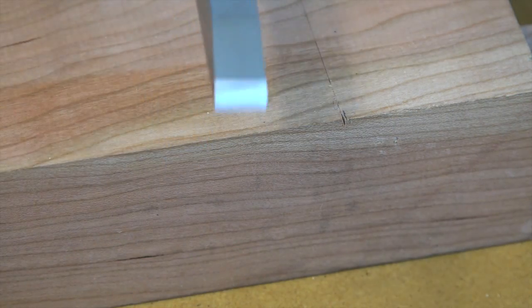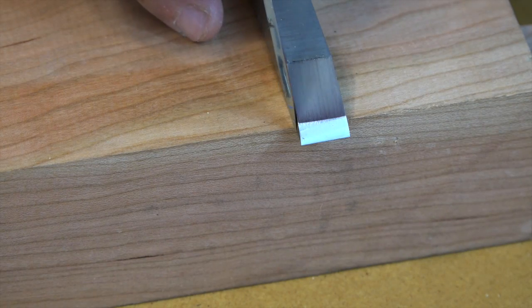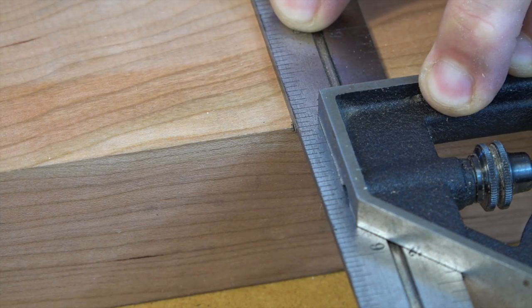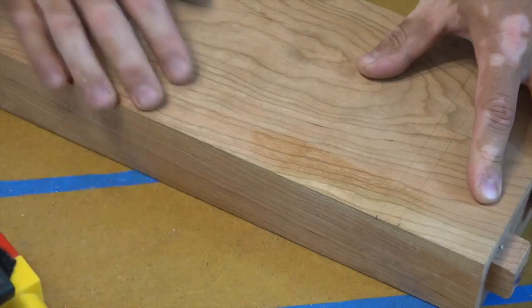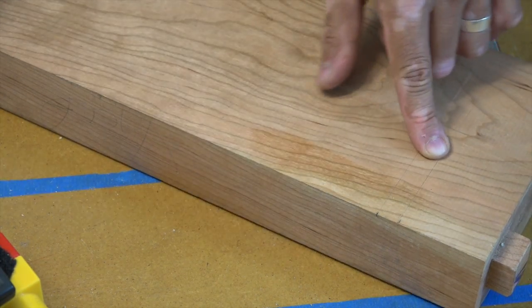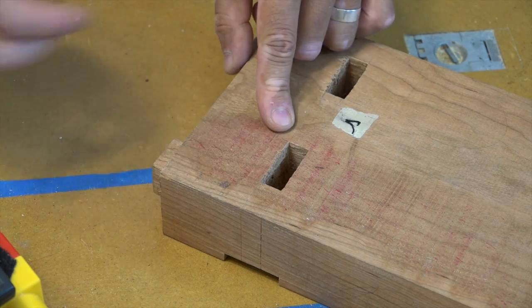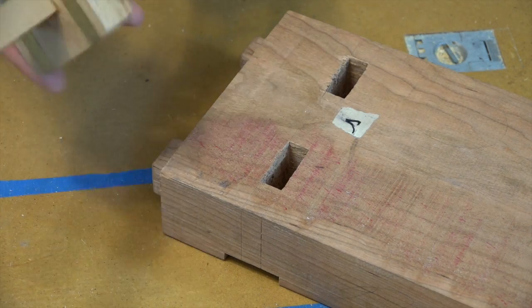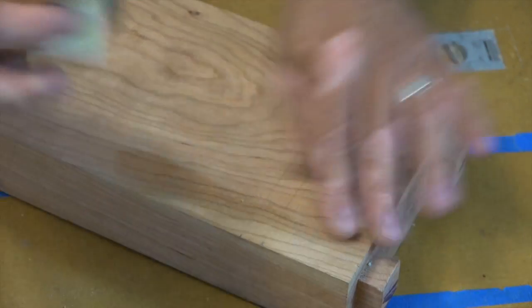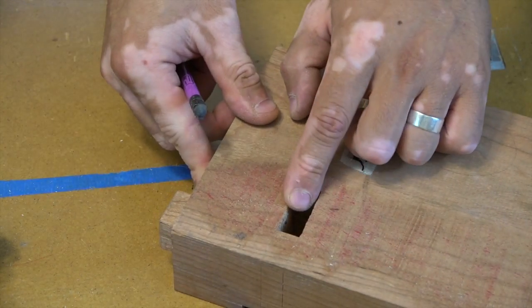Next I'm going to align the chisel I'm going to use up to that reference mark there, just mark the thickness on the other side. So now I'm going to determine where the location of these mortises should be. I'm going to look at these two holes that I had already made. When I scribed these lines, I scribed them a little bit longer than I needed, so that way I can always use the lines to reset my pins. This would ensure that this hole and this one match up.